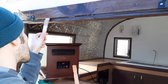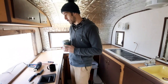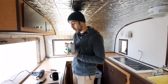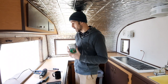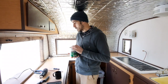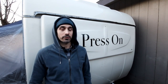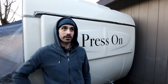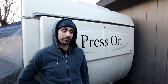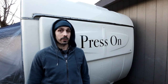I'm just making sure this was completely dried out. I've got my heater in here — it's about 20 degrees right now — so I want to make sure it stays warm in here, because it's supposed to be around 55 degrees or warmer for this to dry properly. That's what I'm doing — resealing. The service window door is in the garage right now. I put the last coat on too thick and it had these milky white spots, so I had to sand it down pretty much smooth before putting on the final coat.